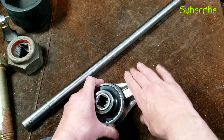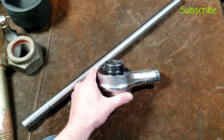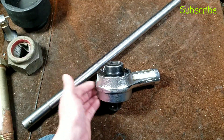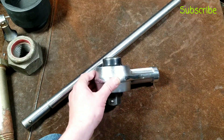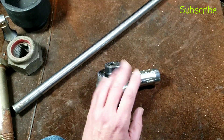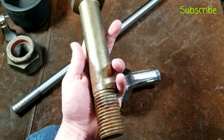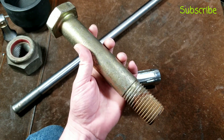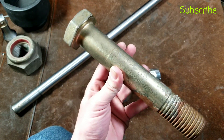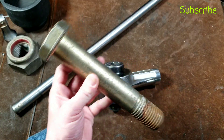One nice thing about the removable handles is you can use various stub lengths, so it's pretty easy to find a place to brace against, and you don't need a 6-foot-long breaker bar. You can use a couple of people on a 3-foot breaker bar and break some very large fasteners. What's surprising is when fasteners get really large — like this fastener here with a 2-3/16-inch head — the scaling of the force you need is real surprising, even with sockets and a big 3/4-inch breaker bar.